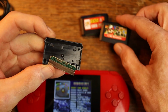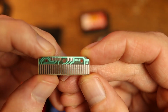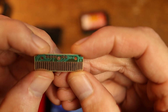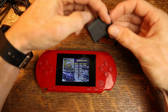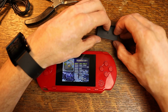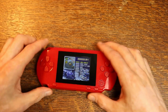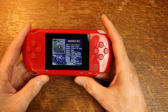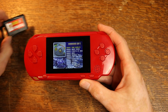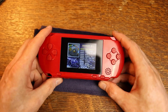If we open one of the cartridges, you can see a tiny PCB with 0 active components. And the only thing it does is bridge 2 contacts. So these game cartridges don't actually contain games, they just trigger a different list which is already present in the PXP3. Now the hardware hack that I want to do, which I found on the internet, I'm gonna link that in the description. With that hardware mod, we don't need these cartridges anymore. Alright, let's open it up and do the mod.